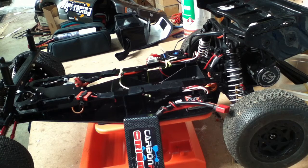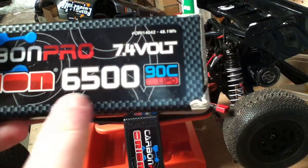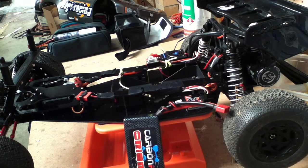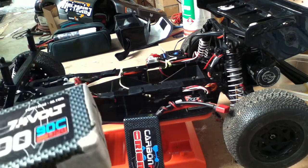That will tell you how much energy is stored inside the battery. This number is 6500 milliamp hours — so that's how much is stored in there. If you drain this at 6.5 amps it'll last an hour.